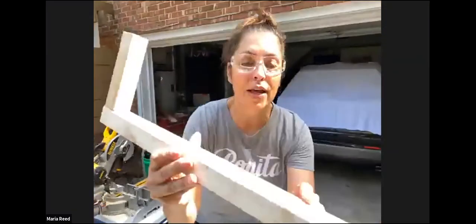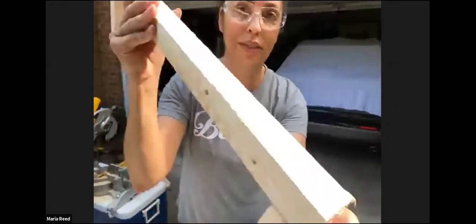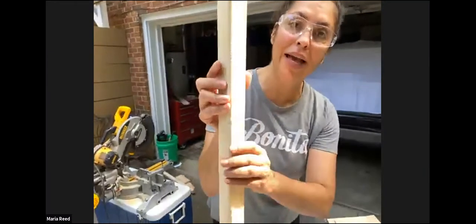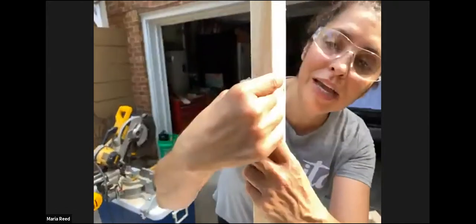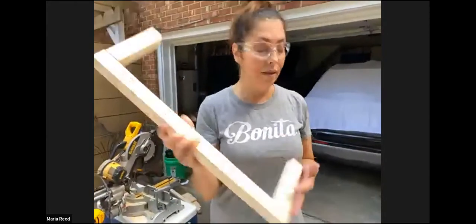Great. And you can come closer too. This is what we call builder construction furring strip. It's really cheap wood. These 2x2x8s are $1.36. Really inexpensive. But you can see it's rough. This is going to require a lot of sanding and even milling the edges. What that means, if you can see, do you see how the edge is kind of rounded? Yeah. If you want to take that off, then you're going to need a table saw. It's more work, but less money.